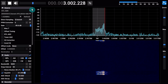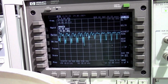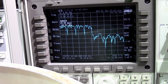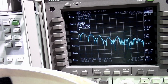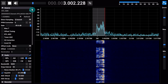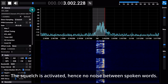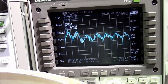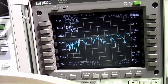Okay, and now if I switch to sideband, you can see that there's some headroom. It's only on the peaks that my audio goes above -30. So the peaks will be more than 1 watt. It'll be close to 2 watts, and that's exactly what I wanted. So judging by the quality of the audio, I think you can pretty much say that it's good enough. It sounds good enough on the audio front, on the quality, and I'm not saturating the amplifier, which was my requirement really.